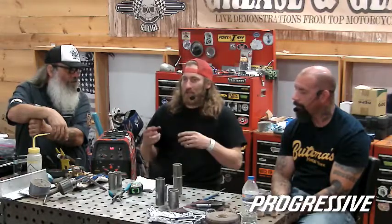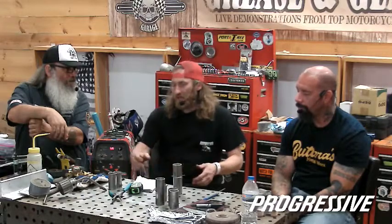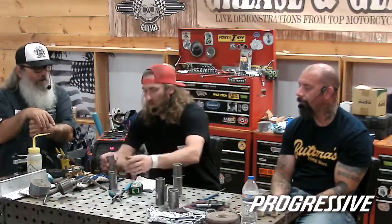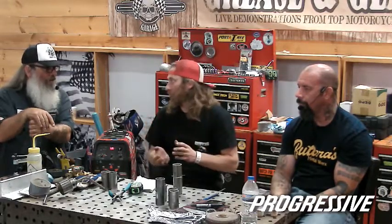One more thing before we move on, touching on coped fittings, coped pipe that butt up to each other. Fitment is huge, not only in a butt weld on exhaust. You could fusion weld this, but if you have a gap, it'll just melt away. But for movement on a piece, as far as the weld pulling, if you have a bigger gap on one side and you start to fill it with rod, that weld is going to shrink a lot more because there's no parent metal there. So it'll pull even harder because there's nothing for it to stop.